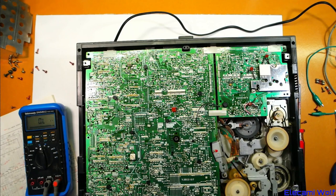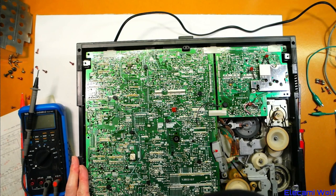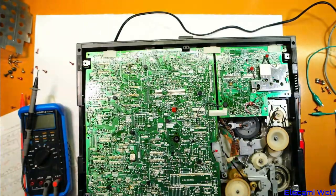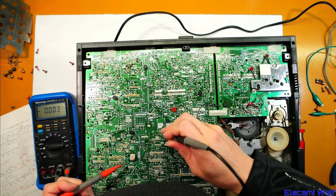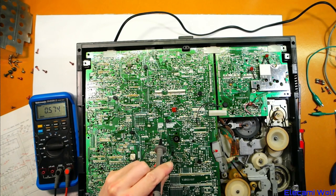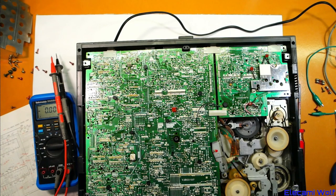The fuse didn't blow and that happened. Why don't we attach a power supply into there and see what that does — or we could see if it's back-feeding a voltage into that part of the circuit through those diodes. 0.5 volts. Nope. Alright, let's feed our own 14-ish volt power supply into there and see if it does anything interesting.